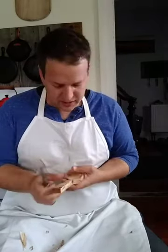One of the reasons I usually stay away from cherry sapwood is it has a lot more moisture in it than the heartwood, so it just feels different. I can tell I'm not getting as clean a finish. But that's okay. One of the nice things about cherry is that it loses moisture fast. So by the time I reach finishing cuts, it will have lost a lot of its moisture.